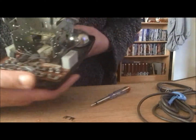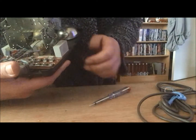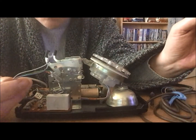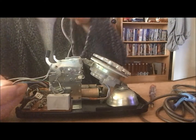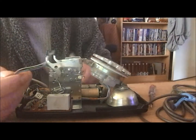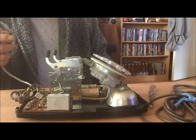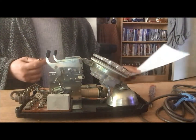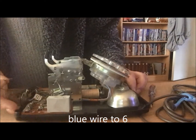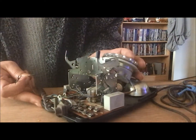That's all been done. Now it's time to connect our new cable, which has all the same coloured wires as what we've taken off and has the new BT plug at the end. You can buy these on the internet for about four pounds. The first wire we're going to connect is the blue wire, and the blue wire goes to terminal number six - one, two, three, four, five, six - terminal six.